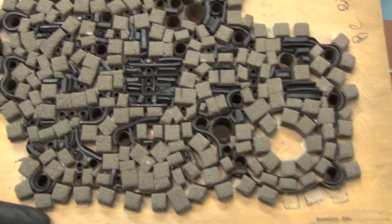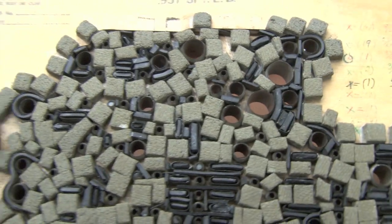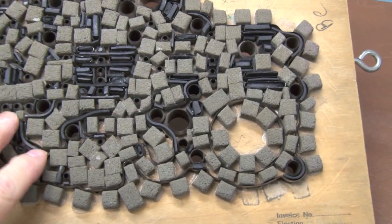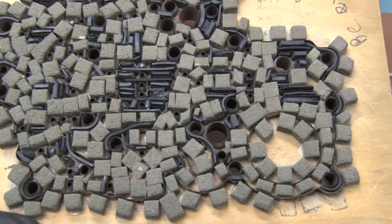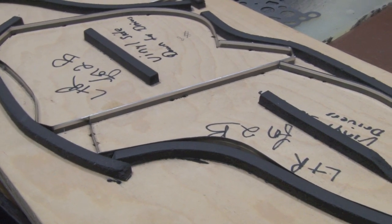On this side you can make out the holes. The steel rule die is harder to make out. The reason there's all this foam is that it helps to eject the gasket from the tooling. So just what is a steel rule die?